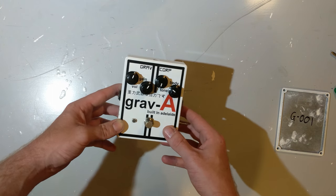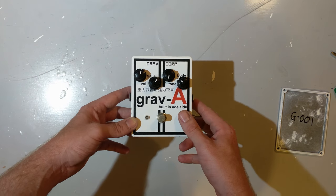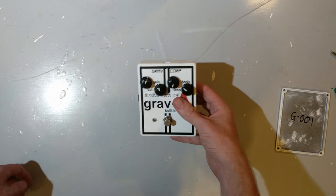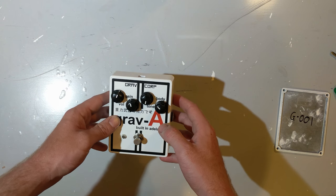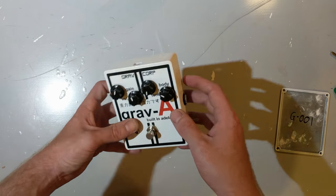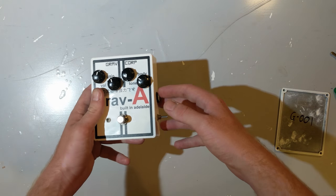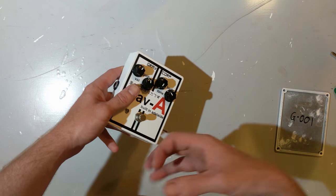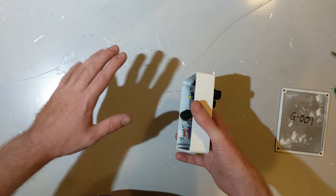I needed to make more pedals, so I ordered a set of 20 LF357s off eBay. Mistake. These were not real parts. They were very, very fake. They looked the part. They actually looked really good. I put them in, soldered up a bunch of pedals, and wondered why the pedals were screaming their heads off. They were oscillating like mad.